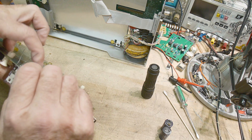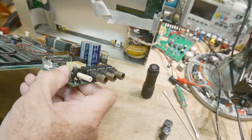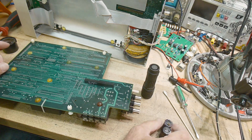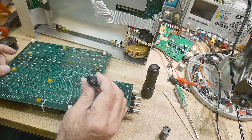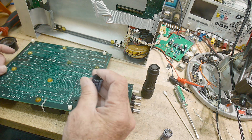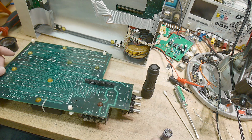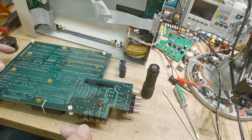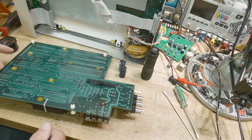Let's bend these leads over. I'll show you a picture of this thing up close — it is nasty. The other one looks okay, but it doesn't feel right. It feels too light, and when you flick the lead it makes a funny little tinny sound. I think it's dry. I think both of these are dead. The 5 volts — the 15 volts seemed to be okay when I looked at them on the voltmeter. Remember I said that 5 volts seems to be low? I think it's because of these capacitors.